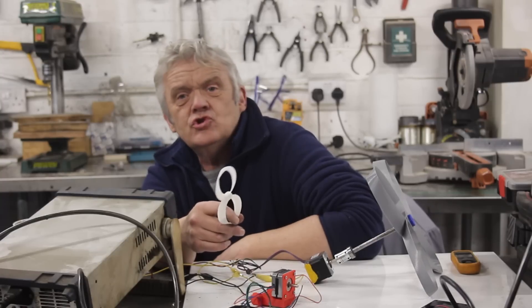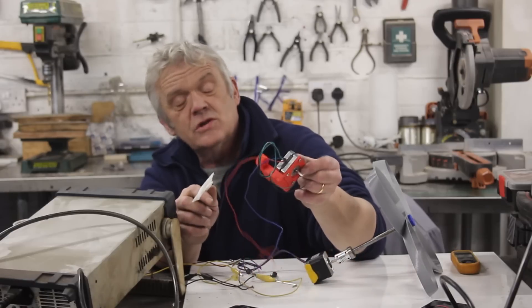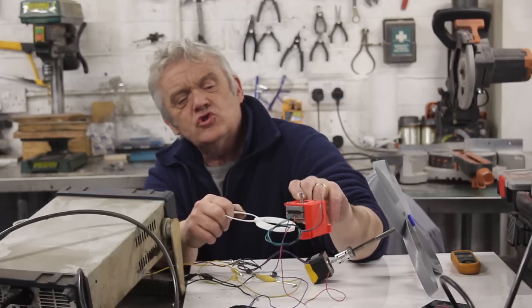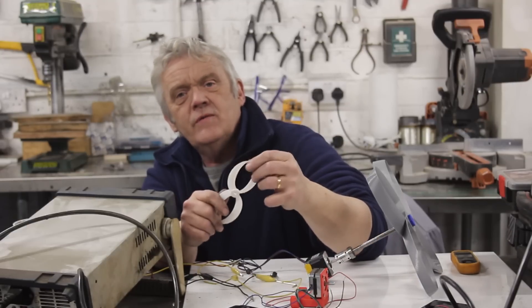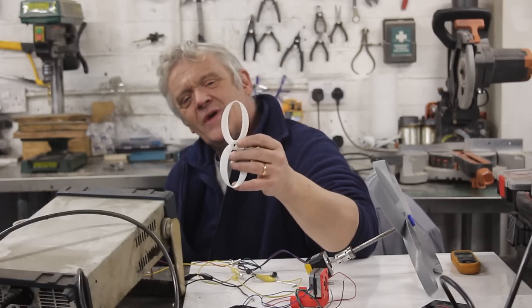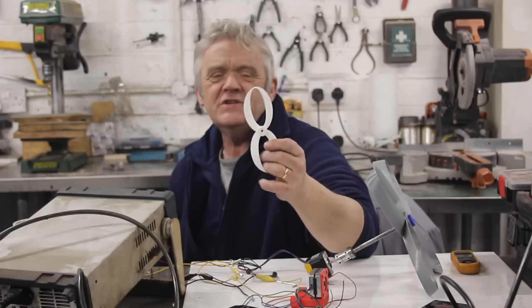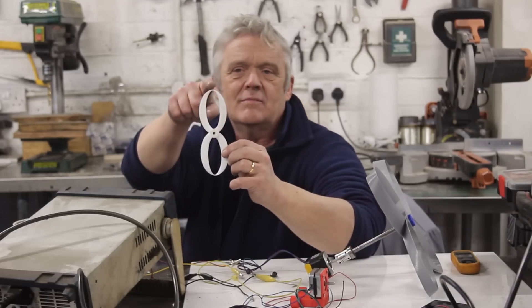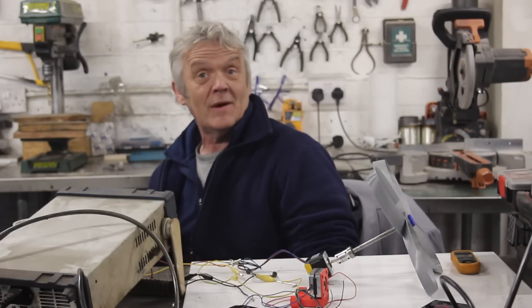Significant differences show up very rapidly indeed. If you bolt this to a motor like that, the motor has its own torque, its own internal resistance. The only thing that's going to vary is speed and therefore output voltage. So I could look at the output voltage — it'll give you an idea if there's going to be anything significant, because if it's super significant, you're going to see it immediately. And that really upset a load of folk. I thought, well, that's a fair comment because really my prejudices are what we're showing. It's got the same swept area, it's got a blade design — I doubt very much that does jack. So let's have a quick look and see if it does. And it didn't. So I could just be displaying my prejudices.